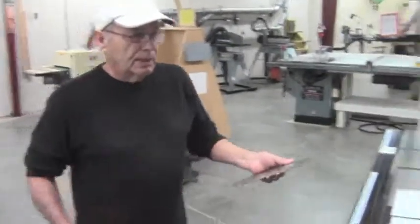If you need a different blade, a special blade for maybe some heavy ripping or some real fine hardwood cutting for fine work, then talk to the manager and ask him if he can get a blade out for you so that you can either put it on yourself or have someone who knows how to change the blades for you. Also, every once in a while you'll see members in here who use their own blades. Some of the members have very fine teeth, thin kerf blades for fine cutting that they put on the saw and then they take off when they're done so that they can handle the type of cutting that they need for their workpiece.